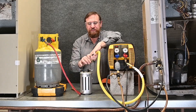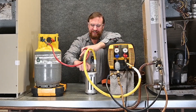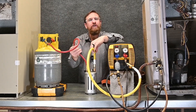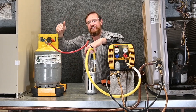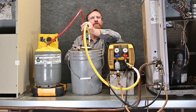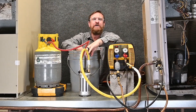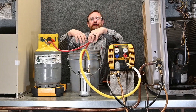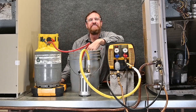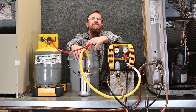We hook our hose into this device and have another hose going out into the recovery tank — that's in series. Then we have our bucket full of ice water. Notice how small this device is — once we drop it into the bucket, there's a lot more surface area and a lot of ice that can melt touching the device, so we cool the refrigerant without putting the whole tank in. This way I can also leave my tank on the scale without worrying about water getting on it.